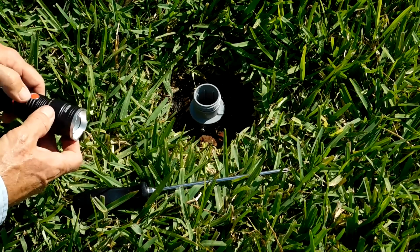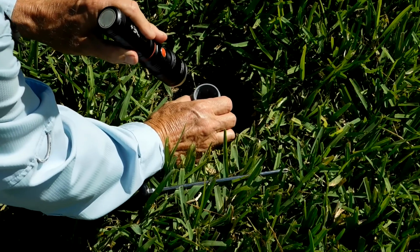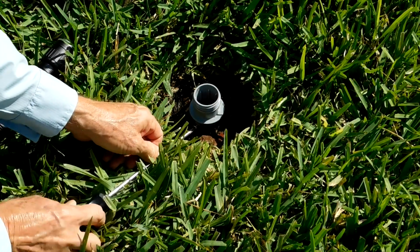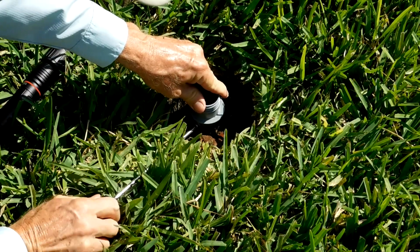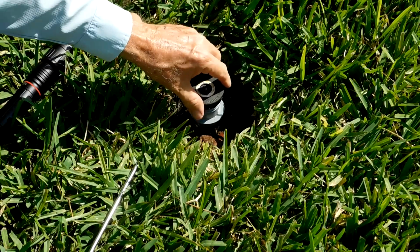Use a flashlight to look inside and further tighten the extension until its splines align with the housing splines. Tighten the set screw. An 8-inch number 2 Phillips or right angle screwdriver works best. Test to make sure the stem assembly slides easily between the extension and the housing.